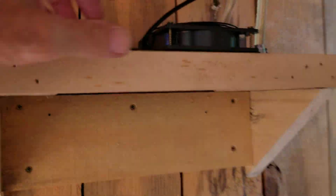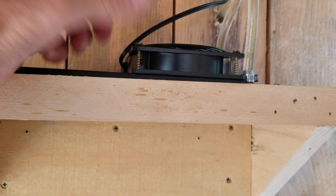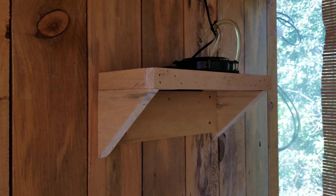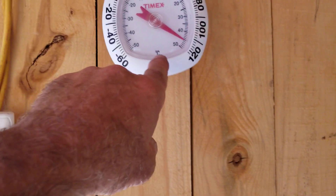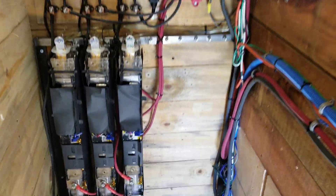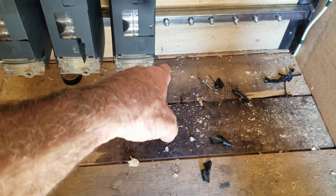The cooling system works fine, but I can clearly see there's no way to cool those batteries with the radiator in this room — all it can do is pull room-temperature air through. I hooked it up for proof of concept and tested it; the control set points all work. But now I need to put the radiator somewhere it can actually pull cold air through the fan, because obviously I'm not going to cool batteries when this room is 110°F.